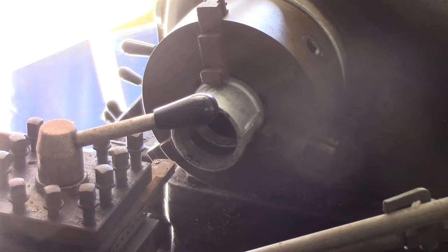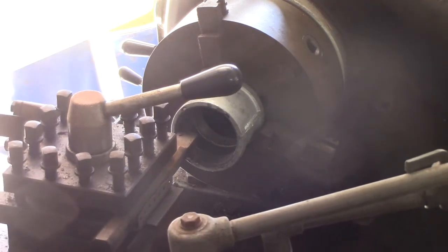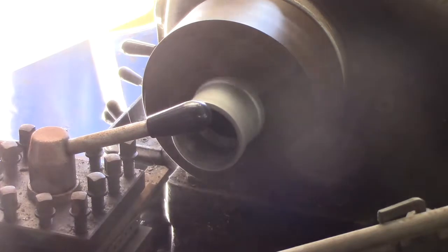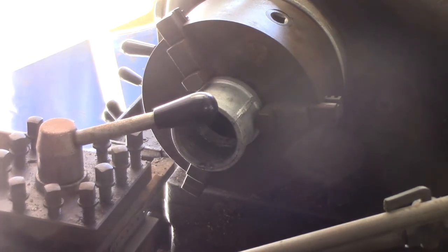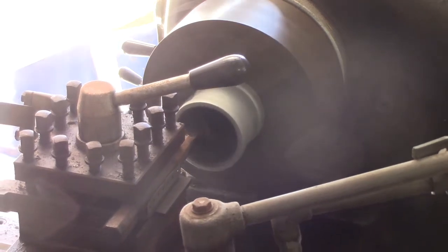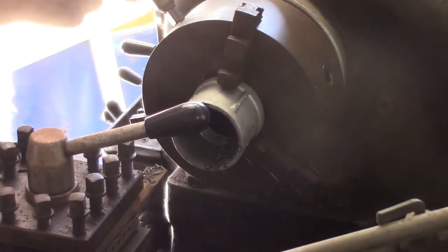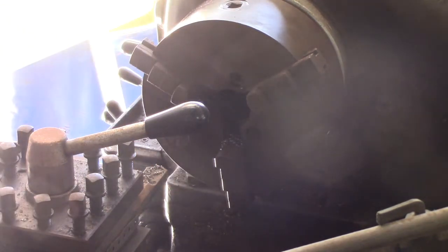We've got 60 thou to come off there, coming off thread, so we ought to be able to take 30 off at a time. So I'll take 30 off, remeasure, and should get one final cut in then. So 2.846. Take another 30 off and remeasure, I think. And that should get us close to where our initial measurement said. And according to that, we've still got about another 8 thou, which would be about right on the initial measurement.